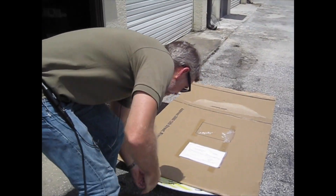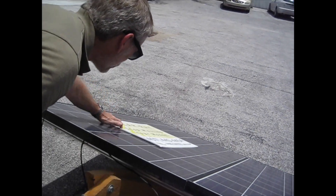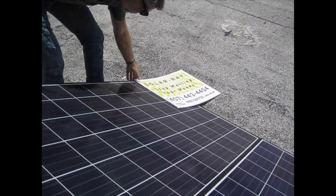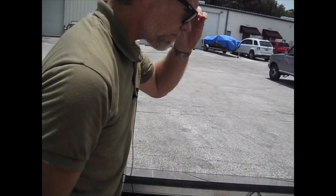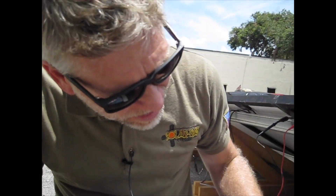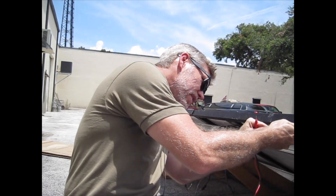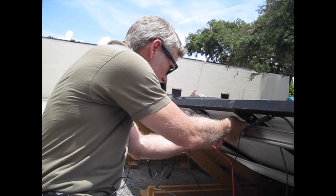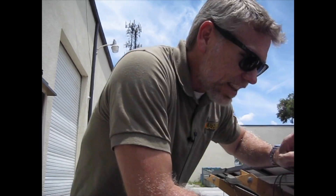Shading — what do you think shades? Cardboard and placard shade. Let's try a little bit of shade. If there's more shade on an array than this, I would almost recommend not putting a solar module there because I don't like shading at all. We were at 124 to 128 volts. With partial shading on one module — 127 volts. Barely changed.